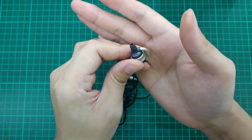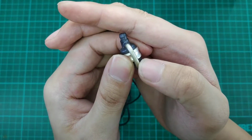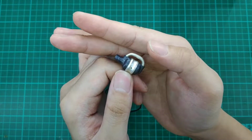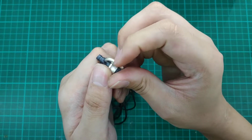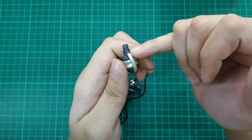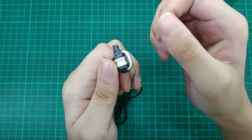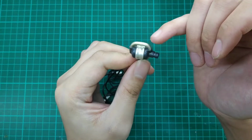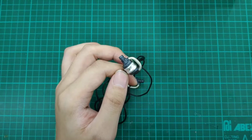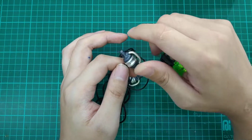This is a very old piece, so I'm not too sure if this yellowing is a sort of coating, because the last few sets have no coating whatsoever on the phase correction tube. They are held on together by glue. So if it's relatively new, you might want to use some proper heat using a heat gun. But we are going to demo using the lighter for speed.